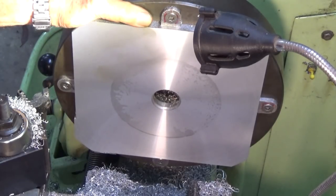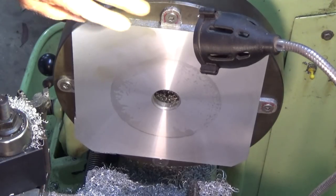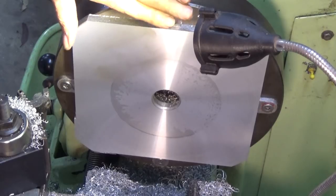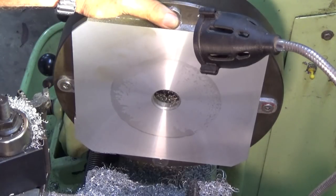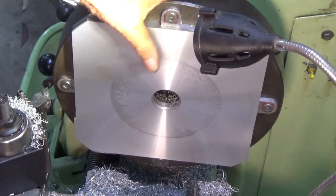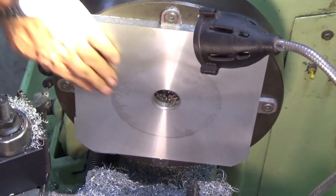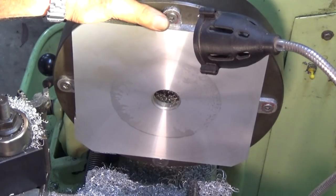That's way better. I just did that final pass there because I knew that the table wasn't flat. When I machined this originally from this side, the back wasn't flat and the clamps or the screws would have distorted that face when I machined it. Flipped it around to the other side, that made it reasonably accurate, and then you really got to turn it a third time and recut this face. But that's looking much better. High-speed steel does a much better job on this alloy.